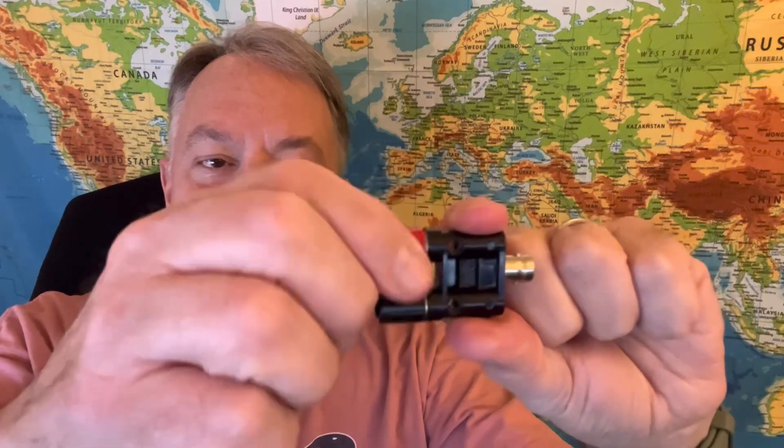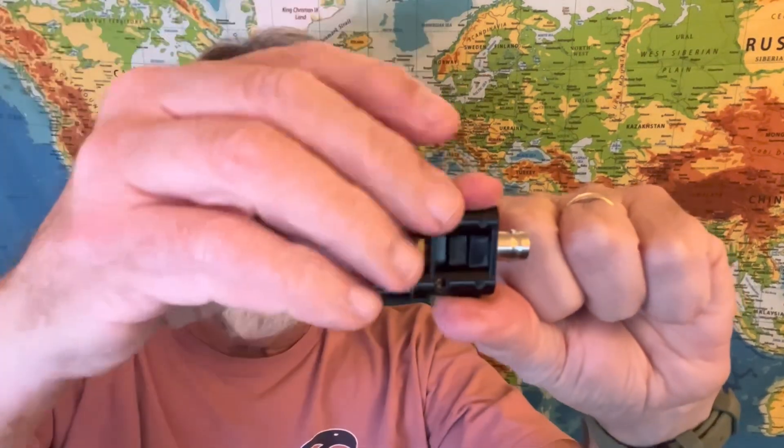You can build one of these simply with a banana plug. The wire goes on the positive, or the red side of the banana plug — that's your driven element, the upper half of the antenna.